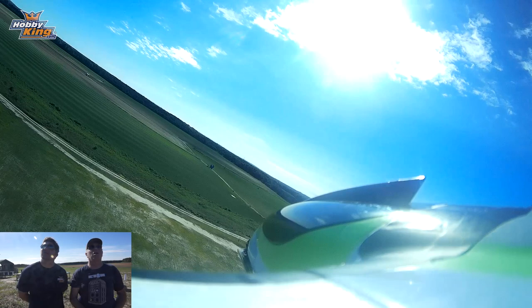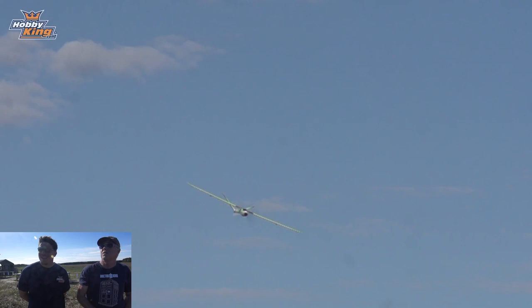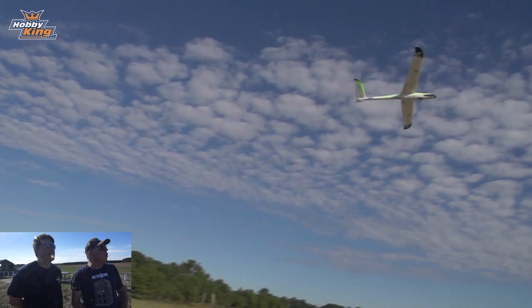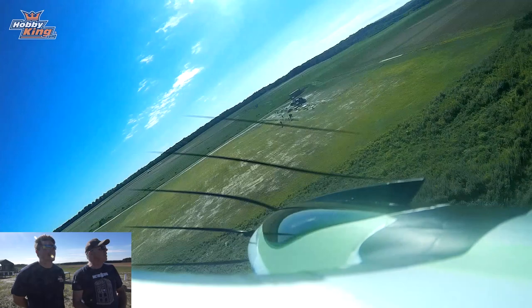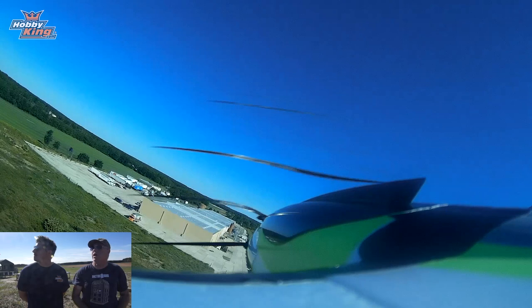Let's show off the air brake feature. The brake on the ESC is very strong — it'll cause that prop to fold in a millisecond, and obviously that saves you on those landings. It also cleans up the airplane for much better glide. You don't want that prop spinning — it's a lot of drag if it's windmilling at idle. It's nice if you need to slow the airplane down: keep the throttle just a couple of clicks above your off position and you can actually get the airplane to slow down a little with the windmilling prop.